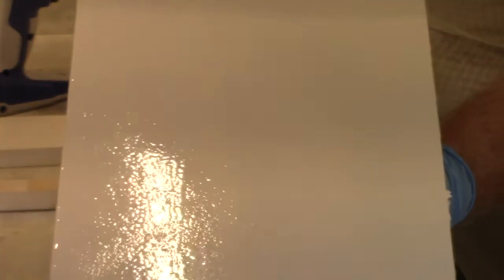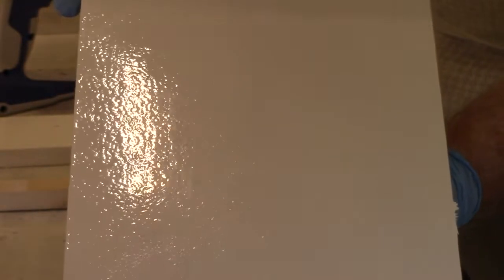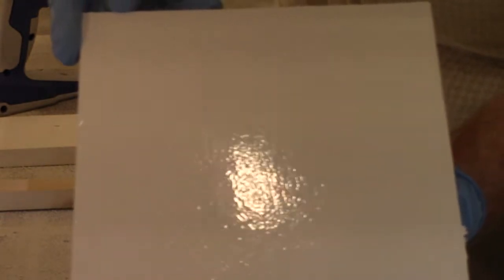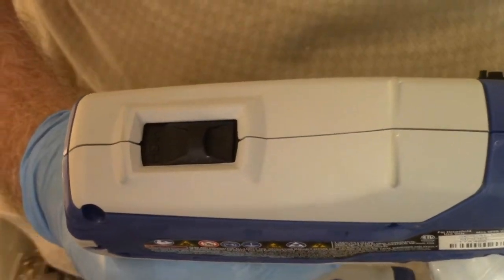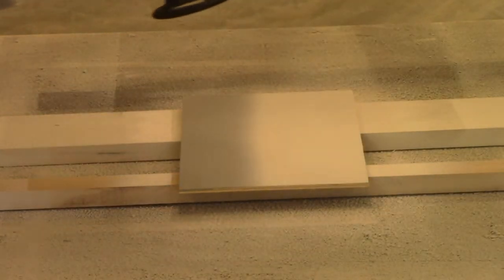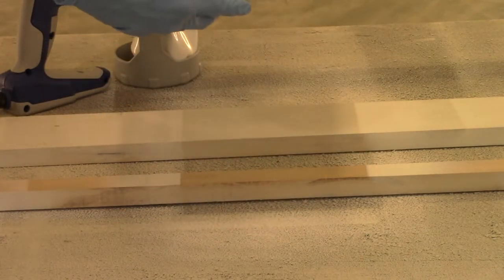I moved a little faster this time and didn't get quite as heavy a coating as with the first sample. One characteristic I'm seeing right away is that with that 15/1000ths of an inch tip, these things put out a lot of material in a hurry. Let's try a sample with the unit set to the higher motor speed. Even moving pretty quickly again, you can see how the faster pump speed built up more material on the surface.